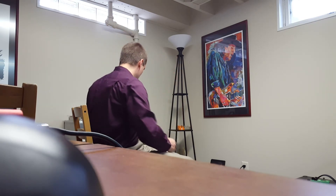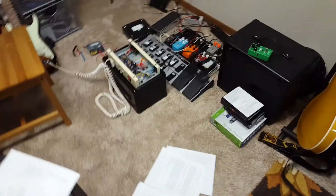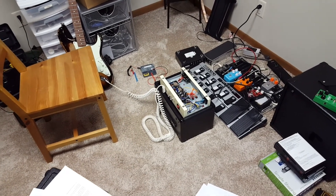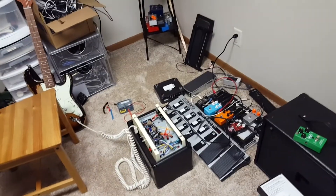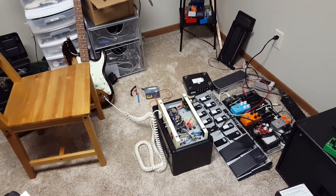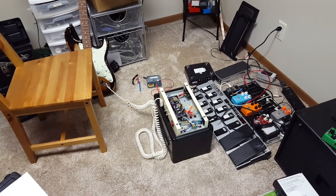I'm really hoping that didn't clip the speaker too terribly badly, but where I ended up there is a really good crunch sound — a lot more definition and a lot less of that flabby, farty low end. Really good sound and something I'm very happy with. This tone control has done more than I expected. I was a little concerned it would only provide high-end roll-off, but it's really sweeping both lows and highs. When I turn that tone control up, the low end is getting cut, which is exactly what I wanted. I'll leave a link in the description — this tone control is extremely simple, you can find these parts on the internet for five bucks and solder it yourself.